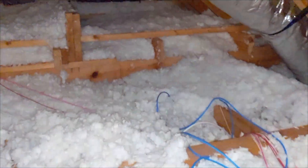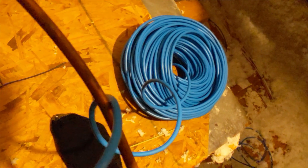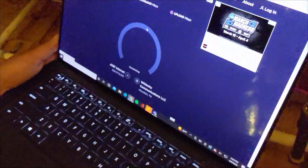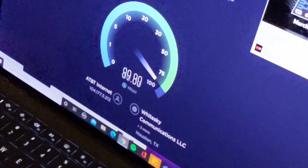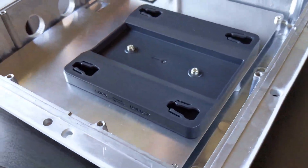I brought the cable up into the attic and dropped it down through the two frames you're seeing here — that's where the cable falls through, which made it very easy to pull the cable out from the other side of the wall. The testing phase is to make sure everything works before running a full install — making sure the splitters and adapters are working, then doing an internet test. I connect a laptop to the ethernet cable that gets plugged into the miner, and if you get a good test result, you're good to go.